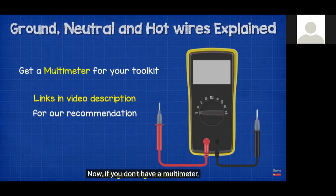The NFPA codebook says don't have any connection to grounds, and there are several reasons. One is that since other systems may have their voltage traveling through earth ground back to their source, there's a possibility that path could go through the fire alarm system and mess up our circuits. Since fire alarms are a life-safety device, they must stay completely isolated and self-powered so that in an emergency — when electricity is going where it's not supposed to be and fire is where it's not supposed to be — the fire alarm will continue to evacuate, notify authorities, and perform its emergency functions.